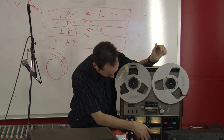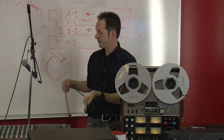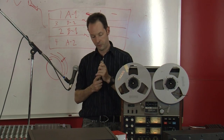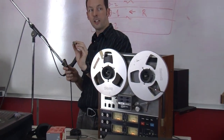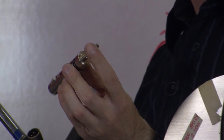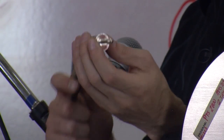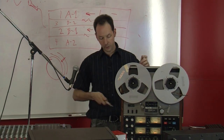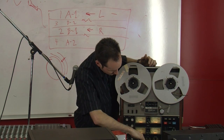And these four plugs here are your mic level inputs. So if we want to take a microphone, like the classic Shure SM58, standard mic, used all over the world, well, it's got an XLR output, so we get an XLR to quarter-inch TS, that's tip-sleeve adapter, it's not balanced, and you just plug that in there, because you can't just plug a mic into the back, it won't work, it doesn't have enough oomph. So we'll plug this in on channel 1,